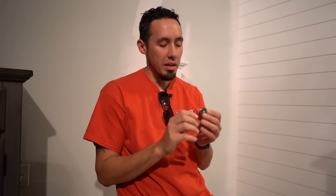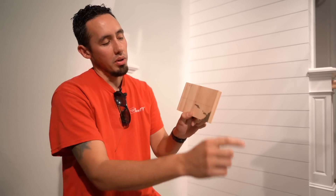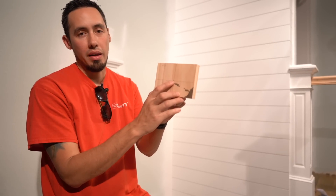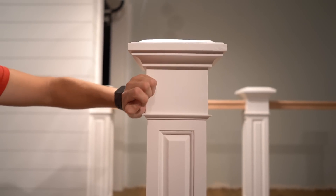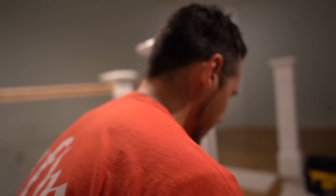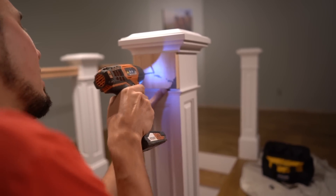The next step is to take this little key slot and put that wider circle up so the shaft will drop into it. I made this jig to do that — it's just a piece of scrap. I wrote 'top' on it, put crosshairs, and made a guide pilot hole for the bit to go in. I'll start with a small bit and then follow with my Forstner bit. So basically I drill into that, take the jig off, follow it with the Forstner bit, put the piece in, and screw it in. Got my jig oriented to the top, lining that up on each edge to get my guide going for my Forstner bit.